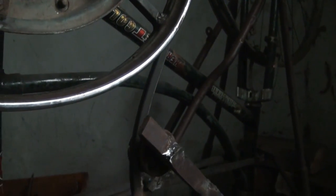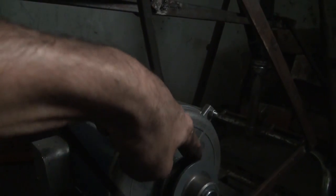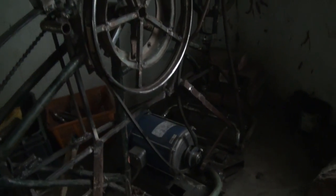I just worked out by pressing down here that it actually just pressed against it. The best place to put this pulley is up here. Or if your belt is nice and tight already and it slips really well, you can put it down here as well, just being careful that it doesn't come together and touch. And that's basically how you make this V-belt pulley slip. So when it's working, it won't catch, and then it engages when you press the pedal.